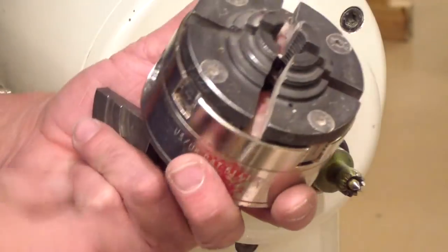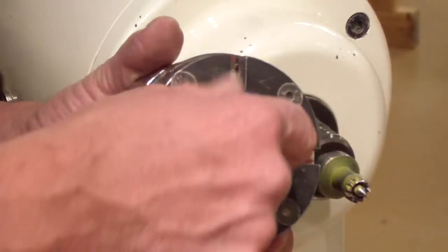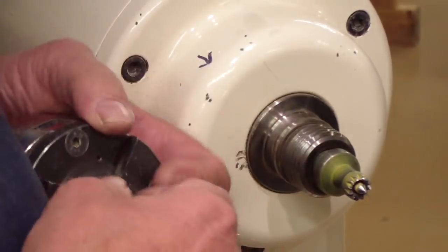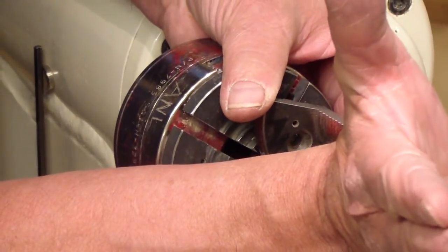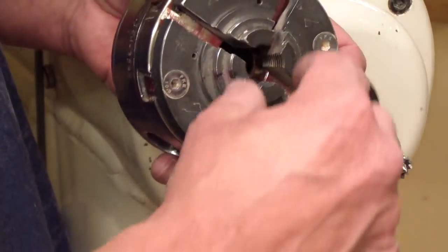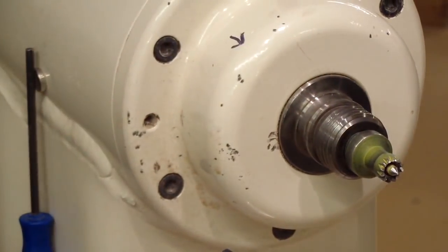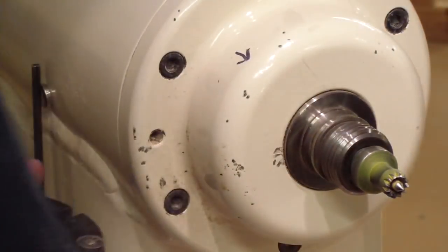I'm going to be using my step jaws. I like these better than the tower jaws, because what happens with these tower jaws is my students over tighten them and eventually they bend out and don't hold anymore. With the step jaws, they have all this support, and then I can also use these three different levels, stair steps, kind of expand into something, which if I'm quick, I can show you that. I can show you how to do a little base.